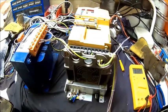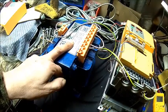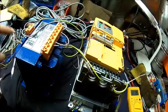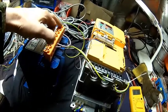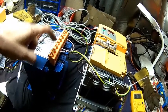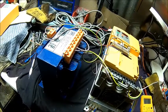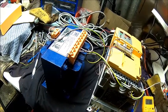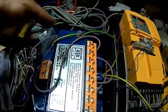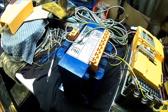One important thing: your transformer must have a good isolation voltage — at least one kilovolt tested — otherwise you may have problems with the secondary winding, because the input is sitting at 230 volts and the secondary end is at 440 volts. The transformer winding must be rated for that. You can't do this with a single-coil autotransformer; it must be a dual-coil transformer — one input coil, one output coil. You can use 220/220 or 230/230 or 240/220 types as they are sometimes around.